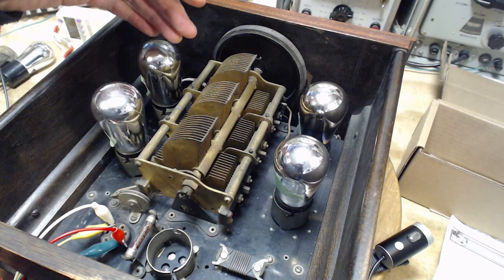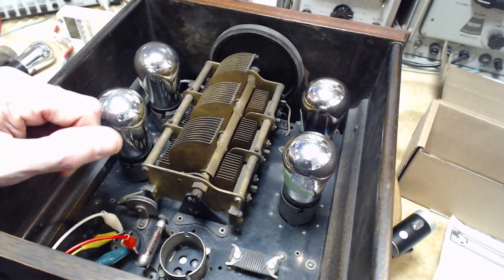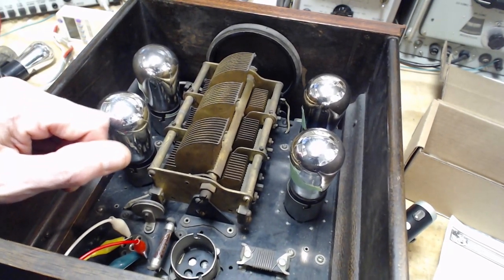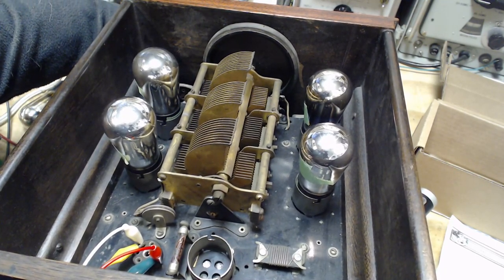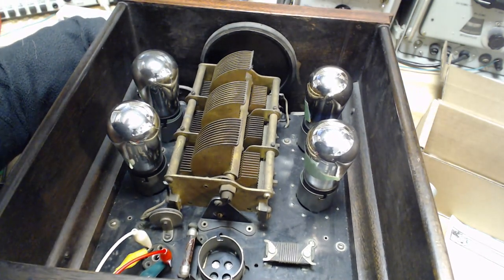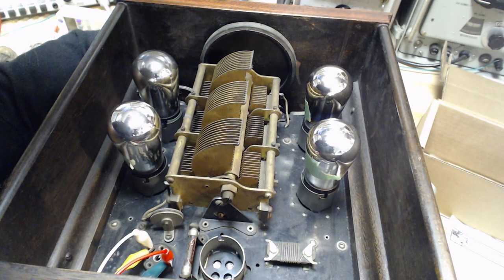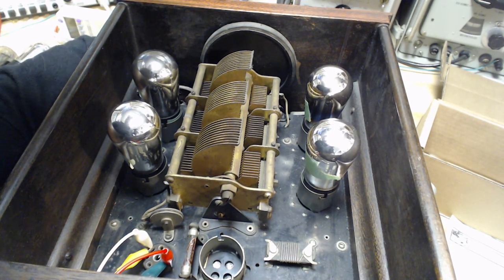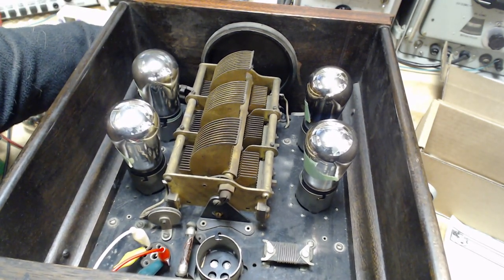The reason I'm concerned is that the first two tubes are controlled by the rheostat — you can just see it back here. And the rheostat is open, or something's up with the rheostat. It's another case of a piece of spring metal — that'll be steel. Steel is where you get good, cheap spring from.